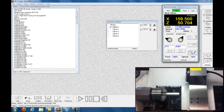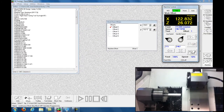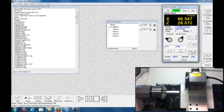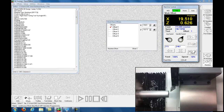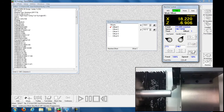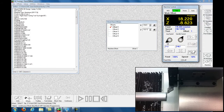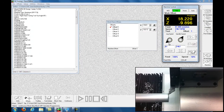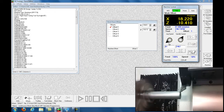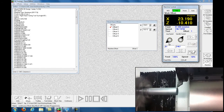I'm going to zero the Z-axis first — I keep thinking like CNC. So I'm moving it closer quite rapidly; I don't want to hit too hard, so now I'm going to slow it down to tap it in closely until I touch the front. I know I built it secure and I skim the front end.